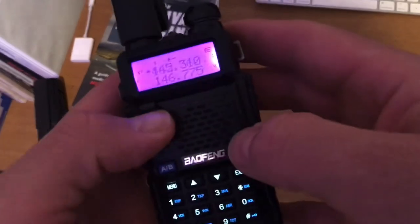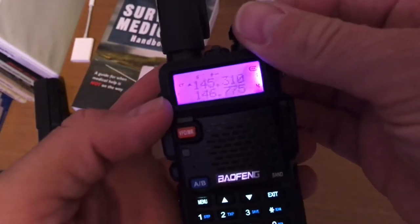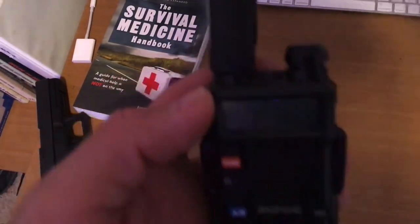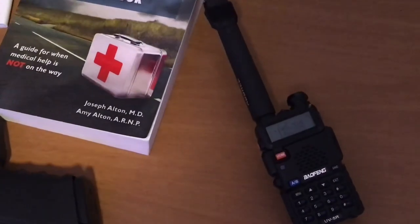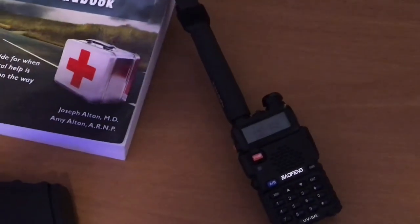And I'm going to go back to channel mode. Whoa, that's a little loud. Go back to my channel mode. Like I said, this 145.310 here in Cheyenne is actually a repeater. And there we go, I have my little Baofeng set up. It works pretty well, and that's how you set it up.